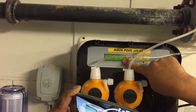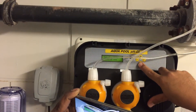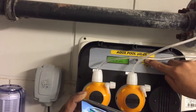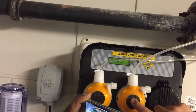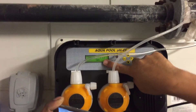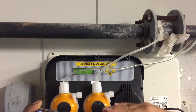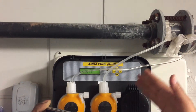Then we go to your set point for chlorine. What's your set point? 1.5. Okay, we'll make this 1.50, then press enter. For the lowest, we'll set 1 ppm. This tells the machine that at 1 ppm it needs to pump at 100%. If you go below 1 ppm the pumping will go to 100%, not 50%. But once it reaches 1 ppm it will come back to 50%. That's finished for the set points.